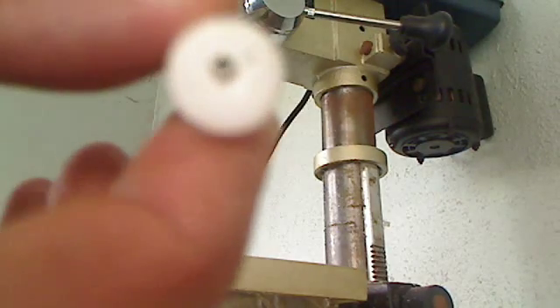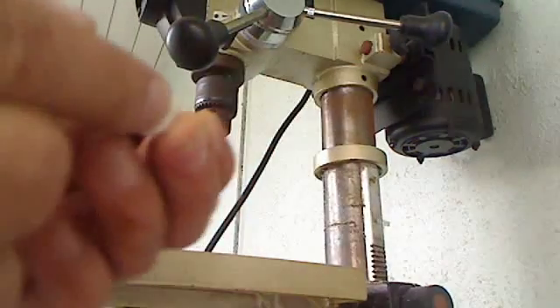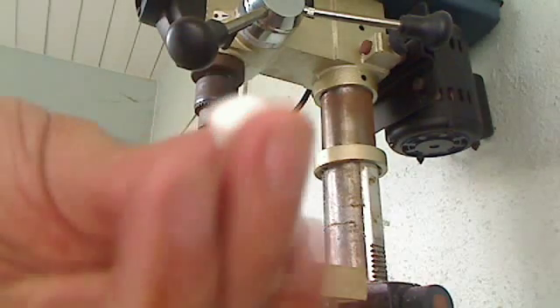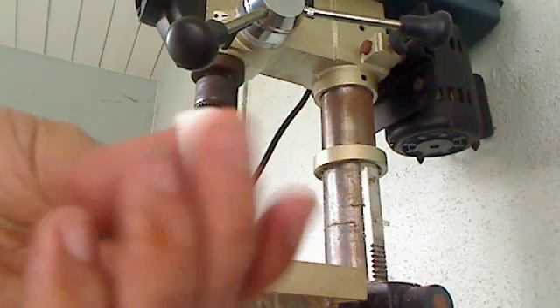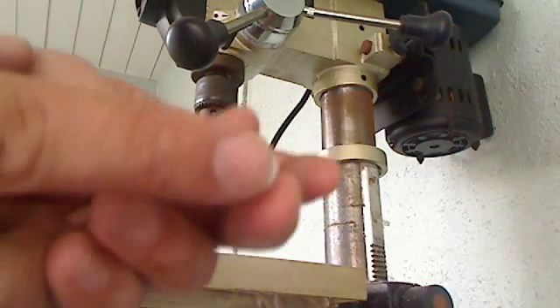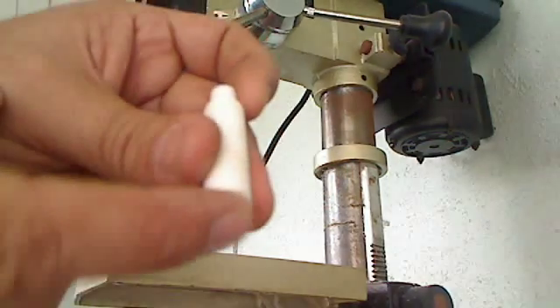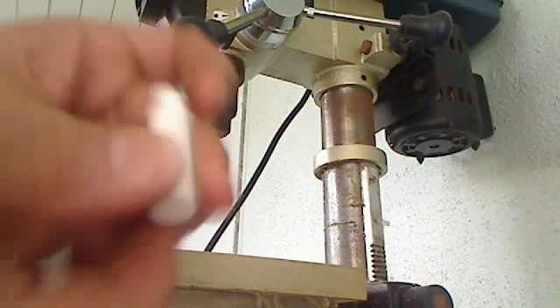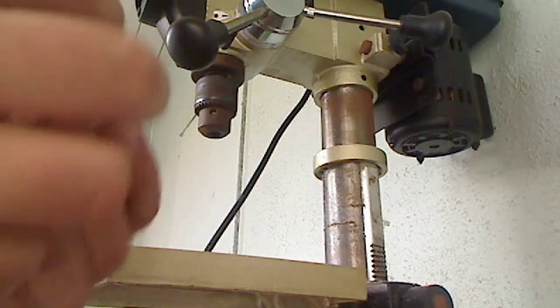Like them apples, huh? So if all went well that should be right through the center — it's not, but it's close enough. I always put a piece of filament through the extruder and through the PTFE rod before I tighten it down, and that ensures that the hole is centered. It pretty much stays there — I don't have a whole lot of problem with that moving around. If you feel a little nervous about it, you can always open up this end of the PTFE slightly, because having that end slightly open is not going to affect the operation of the hot end too much.